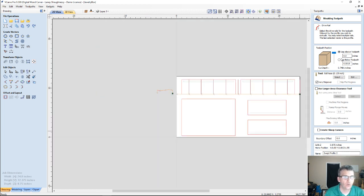And so I'm going to be using a 1/8 inch end mill for this, most likely because this is just a very simple curve. I could use a 1/4 inch ball nose end mill instead of a 1/8 inch, you know, make the toolpath faster and all, but I'll use my 1/8 inch ball nose end mill for this project.